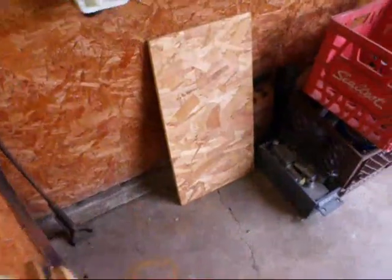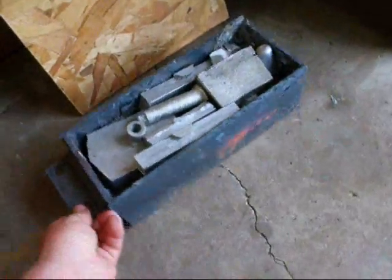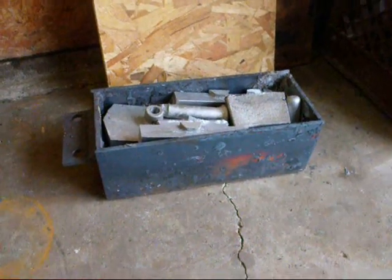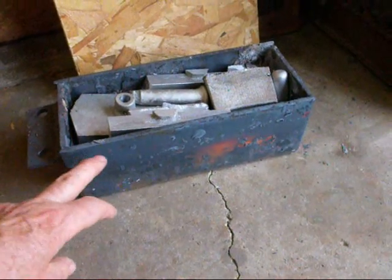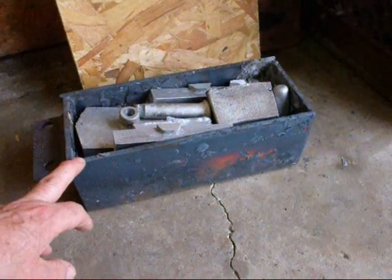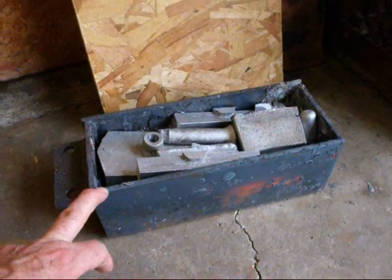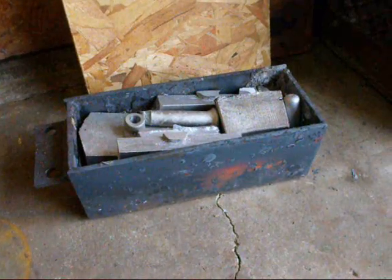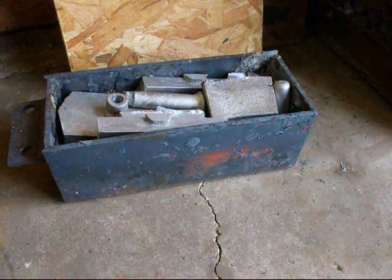When I pour these bigger castings, I had to make a bigger pot. It's not really a crucible — it's an iron steel pot that I welded together, but it's about 10 or 11 inches long, and it'll hold plenty of aluminum compared to the little one I normally use. You always want to make sure you have enough because you can't add more once the pour has been completed. Hopefully in an hour or two I will have a good casting to show you.